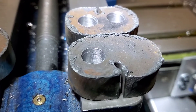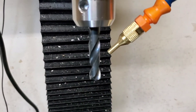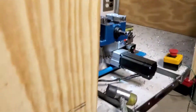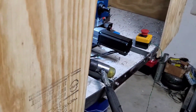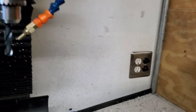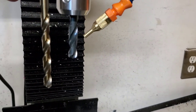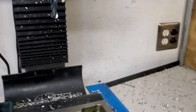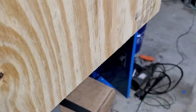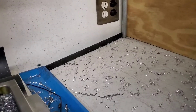So I ended up at 2 inches per minute — I think this is it. I also switched to a stubby machine drill bit compared to one of these jobber drill bits with so much stick-out. This is actually a smaller size; let me get the correct size — it's hiding over here somewhere. Here you are.